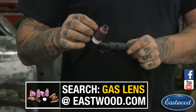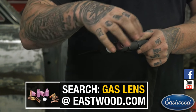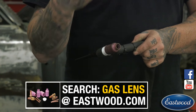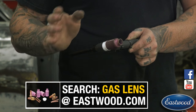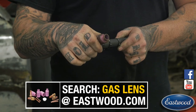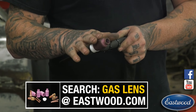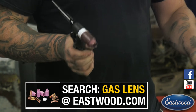Gas lens kit has a screen in here, if you're not familiar, that puts a plume of gas out that basically fogs the area that you're welding. It's much more efficient, with better coverage than the traditional style that comes with the machine as standard. The gas lens kit's gonna be a lot better. It's gonna cover a better area. And for what we're doing, we want as much gas coverage as we can get.